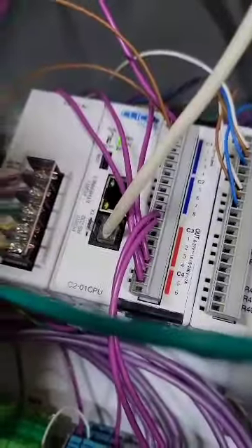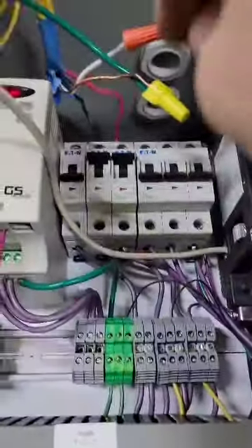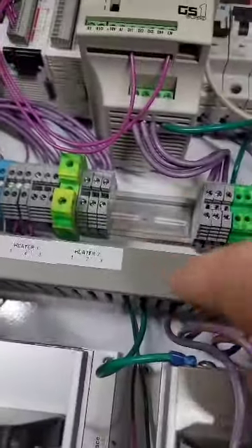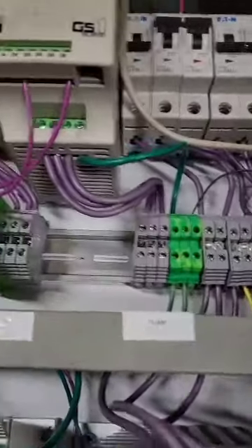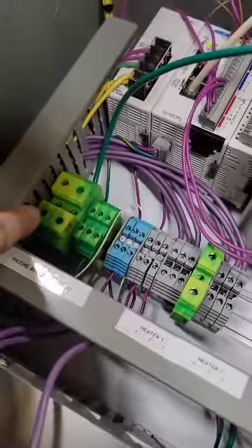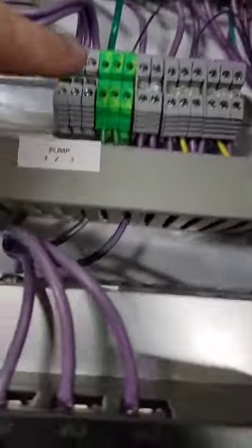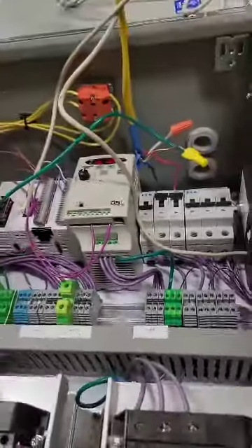Your e-stop is here — e-stop kills power, you can see power going on with that. I'll clean up this data cable. I'm running 220 off one of our down spigots here, so I'm hooking my ground up to incoming and an extra ground here. Your heater pump legs are one, two, three, and then there's an extra spot on this ground for the pump. It's only five amps — I'm running ground straight to here, but they're all connected anyway.